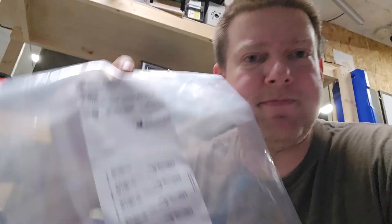There are so many memes about not needing the Pythagorean theorem in daily life, but unfortunately if you're a biomed and you work on electronics, Ohm's law does actually come into play — here's just another example. This unit burned out a power switch, and power switches shouldn't normally burn out. If you have anything from a burnt fuse to a clunky power switch, monitor your equipment current. When you replace a part, the weakest link is what breaks, and in this case it was the power switch — it's probably also only rated for 15 amps.